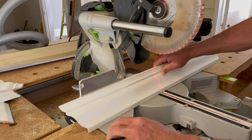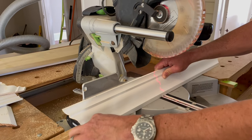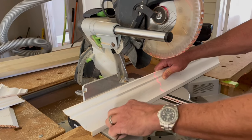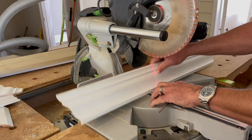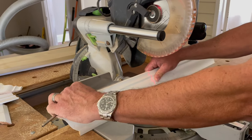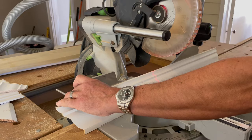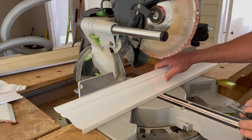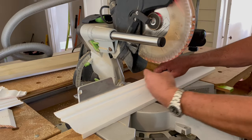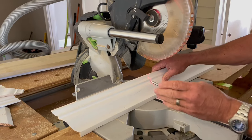When you haven't been doing this for a while, you can attach a board across that acts as a guide — you can do one on each side so that when you set it up it'll go right to its spot. I've been doing it long enough that I just put a line and hold it while I cut it. Next, let's go on to how to know which way to cut the molding.